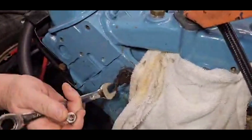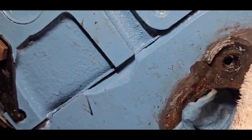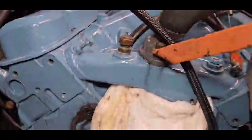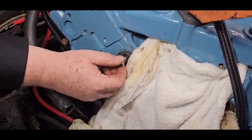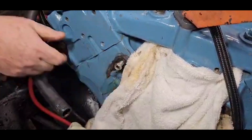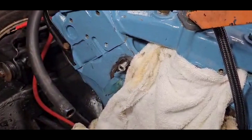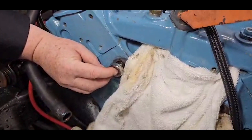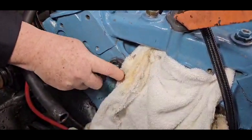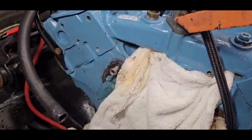Looking in, you can see the hole is centered up nicely on the threads. That's the biggest problem when trying to pull a bolt out — getting off-center, and then your easy out goes into the threads. A lot of YouTube searching didn't show this technique; Mike kind of made it up. If you never want to stop learning, don't be selfish — share knowledge, because a day where you don't learn something is a wasted day.